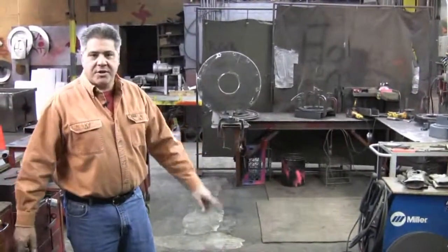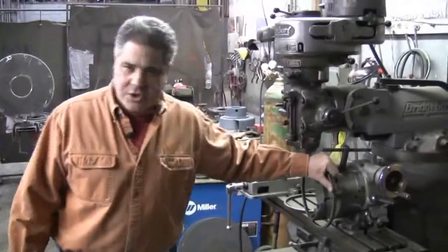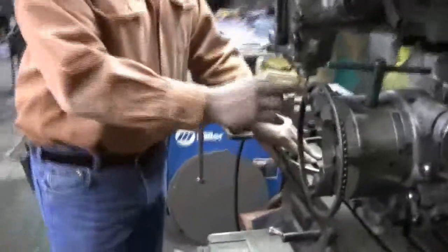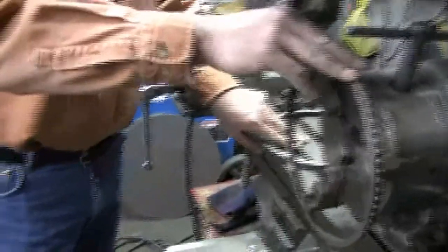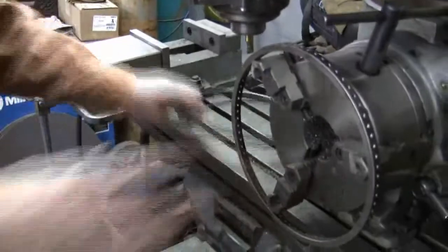There's no other organization that does what we do. This is our gas ring. Our gas ring is specifically designed to maximize efficiency. We have a 33-degree angle on every hole that gets incorporated into every gas ring. This gives more complete burn rather than just pumping the raw natural gas into a combustion area in the burner. Everything is fabricated here.